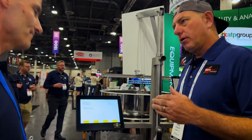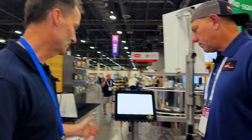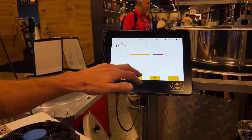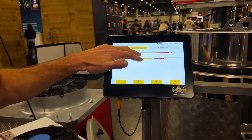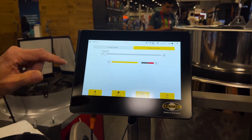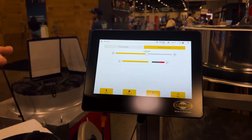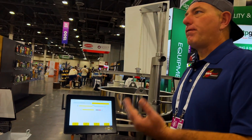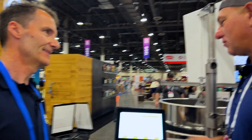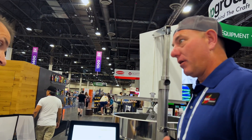The way it measures the water is not a flow meter — it's actually measuring the pressure. It takes the level from the pressure and counts out to 230 liters. For the pump regulation, you can regulate by pump speed if you want, but it's more important to have the same pressure inside of the mash pipe. So it's more interesting to control it by pressure — you set the pressure to what you want and it keeps the same pressure inside the mash pipe all the time. That's the important thing. If you're starting to get a stuck mash and it's compressing, the pressure is what it's sensing. You're always going to have that same amount of pressure — it's not just controlling the speed of the pump. I don't think I've seen anything like that on other commercial systems. I think it's unique.